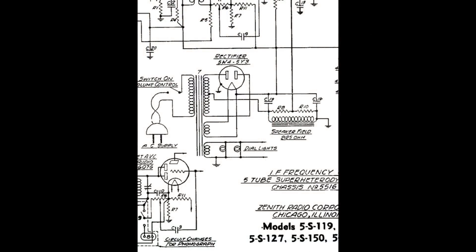The first thing I did was look at the power transformer. Here I'm highlighting the primary to the left and the secondary to the right of the high voltage section. Many of these Zenith radios I've had in the past have had bad transformers — sometimes they get stretched to the max for the design. In many cases you may have a bad rectifier tube, old shoddy electrolytic capacitors, or other components that have shorted. Next thing you know you've zapped a power transformer, which is not easy to replace and can be expensive, so if you're not accustomed to working on these devices I'd recommend not plugging them in.